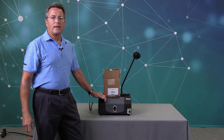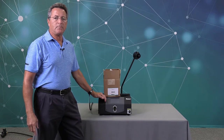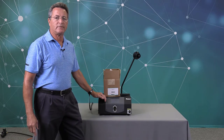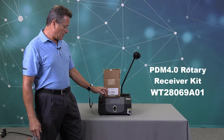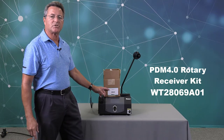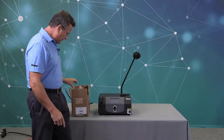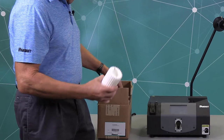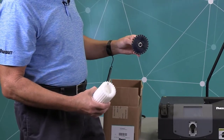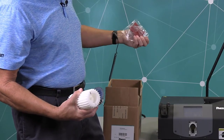In this video, I'll be demonstrating how to replace the rotary receiver kit in the PDM 4.0 dispenser unit. First, order the rotary receiver kit, which is part number WT28069A01. What comes in that kit is the rotary receiver. There is actually a coupler with a timing disc on it, and there's also some 242 Loctite with a couple of small set screws.